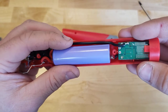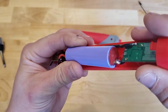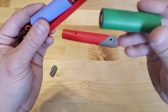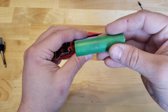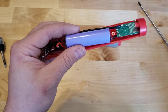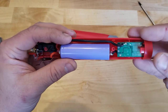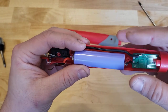I do wish that this 18650 was removable. It is definitely replaceable to some extent — you could definitely remove those plates or just solder these leads onto another 18650 that you had laying around. So you could definitely take this and replace it should it ever die on you and not start charging. But opening it up and having to re-solder it is a bit of an inconvenience. I think an improvement on this unit, even if it was maybe a different model or slightly higher price, would be making this 18650 a removable, changeable cell.